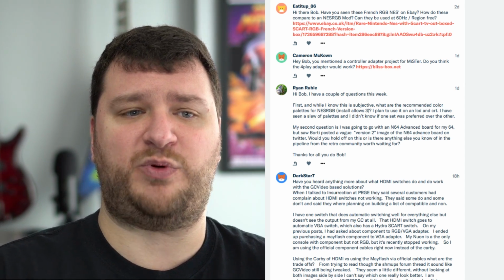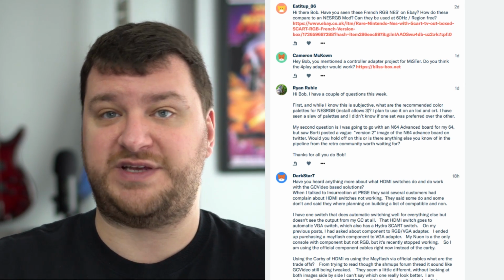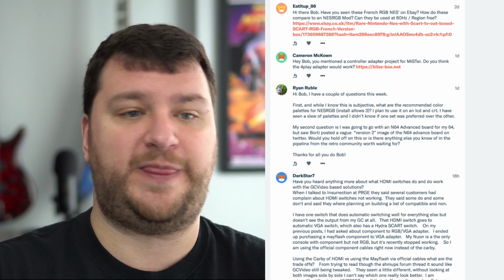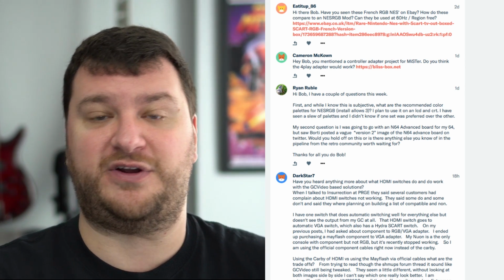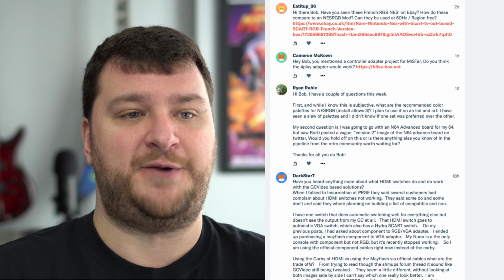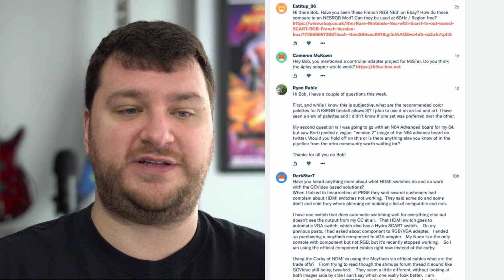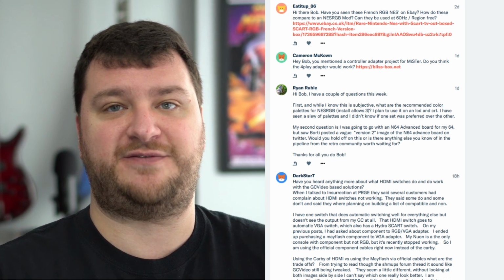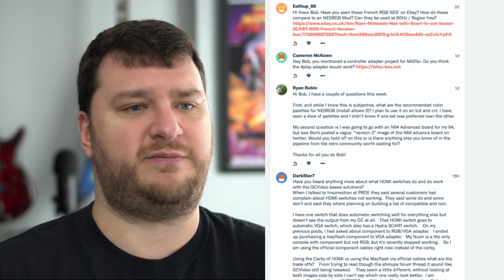I mean, at that point, that's more like an analog version of the Ultra HDMI. Of course, I mean that in a good way, but depending on your needs, you might even get an Ultra HDMI and a VGA converter if that was really going to be your focus. But if you really just wanted an excellent RGB-based one that could be used on all N64s, have all the deblur stuff in the 15-bit color mode, just get Bordy's regular board or Tim Worthington's.